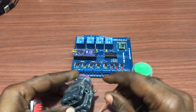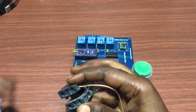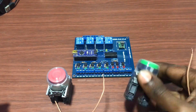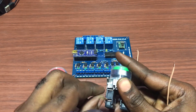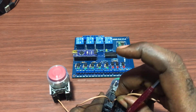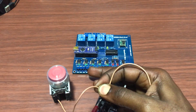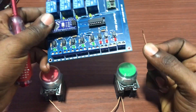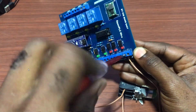So we have a brown cable connected to the normally open contact of one of our switches, and it's at pin 3. We check how firm it is. We connect the other section also to the second push button, at pin 3 as well. We add an additional cable which will loop to our power supply — that is the 12V point of our board. With everything firm, we will now connect it to the 12V point of our board and screw it in position tightly.